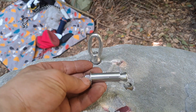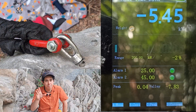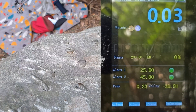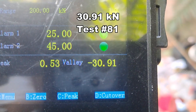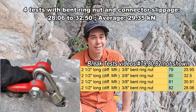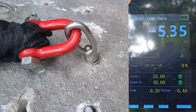Now pulling with the unbent or new ring nut, with no slippage happening in the eye: in 11 tests we got a range of 14 to 45 kN, with an average of 30 kN. We wanted to know if the connector slipping in the bent ring nut drastically affects the test, so we tested a few more bolts of the same size and metal bought from a different manufacturer and seller. Notice the really big slip in the eye — 30.91 kN on that. All had notable slippage in the eye but broke at an average of 29 kN. Even an old Petzl bolt had slippage and broke at 36 kN.